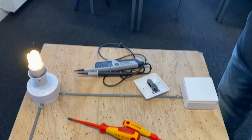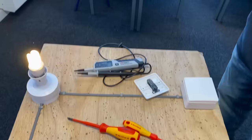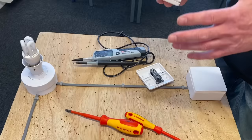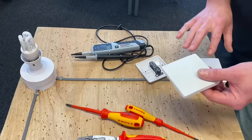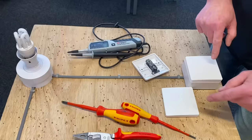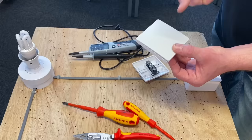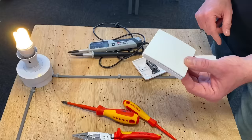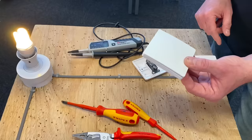That paired switch can be used up to 25 metres indoors — with obstacles like doors and walls — and 80 metres outside in free air. They're IP-rated as well. This receiver is installed inside replacing a one-way switch, allowing you to add two-way switching. Look how simple that was — that's something they didn't teach you at college! By operating the switch, it creates kinetic movement which creates energy, sends a radio frequency through the air, picked up by the receiver, which changes the output on or off depending on its last position.